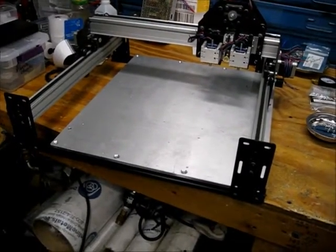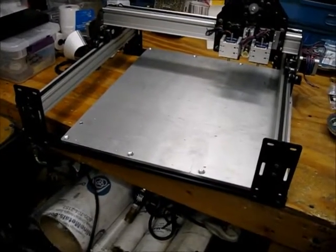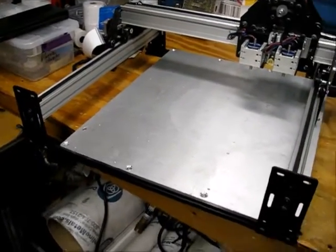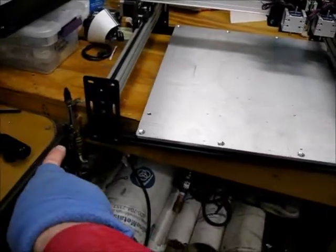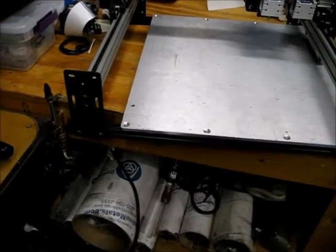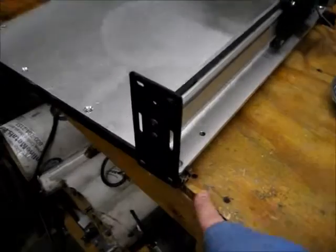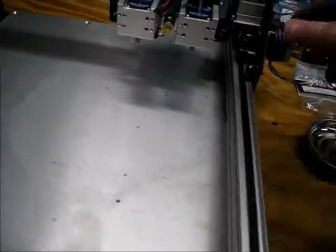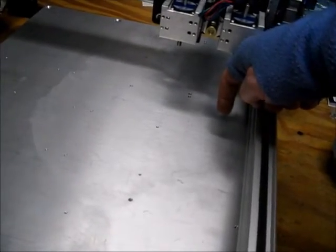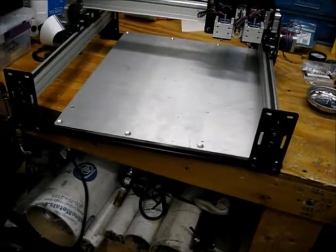I was able to slide everything back on. I slid the rails onto the plate first and then slid the whole top assembly back in from one end. Currently none of this is tightened down to the rails. I'm going to flush up the rails on one end so the excess sticks off the other side, where I'll eventually mount a cable track. I'm also going to center the plate in the middle of the gantry. The plate won't go all the way to the edge, but that space under the Y-axis isn't usable because the head can't get there anyway. This is going to be way stiffer than particle board ever could be.